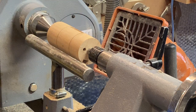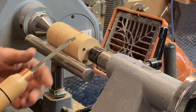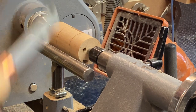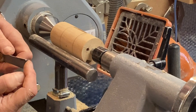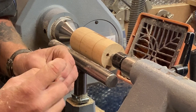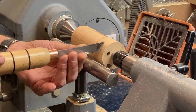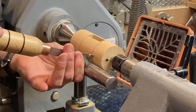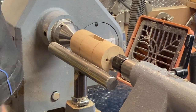Right. Now, just a quick one, because a couple of people have had my parting tools and they're having trouble using them. With this, because it's a saw blade, the teeth are set at an angle. They normally would have a point on them, so I have to take that point off, which I do with the diamond file. But you do have a slight chamfer on the metal here. It's meant to be there, that's how the saw blade is. When you come in, you can't come in straight with it because it naturally wants to go up. Don't lower your tool rest down, it's way above centre. All you have to do is come up, lift the tool up and head for centre, and it comes in. Very easy and works efficiently. So I'll show you now.